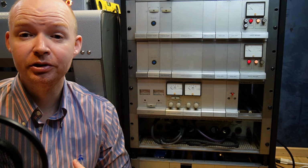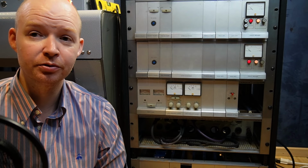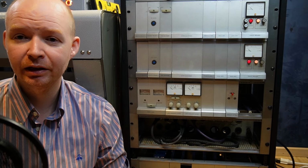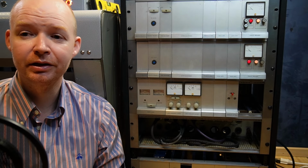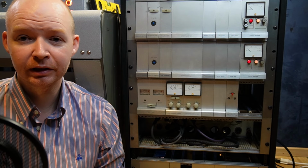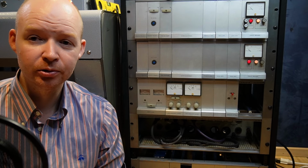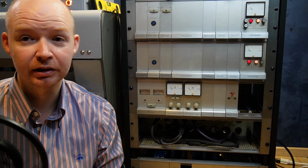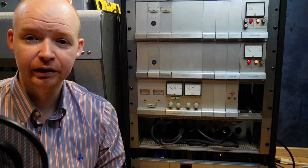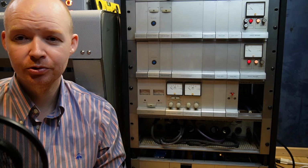As much as I would love to blast everything through the amps at max volume, one of those old cutter heads now goes for over $20,000 US. Nobody's really making new ones in any kind of volume, and I can count the techs able to repair those on one hand. Most of the studios cutting now are small operations with 1 or 2 people, and they can't afford to keep 2 or 3 spare heads on hand just in case. So if someone's thrash metal EP pops your cutter head, you could be down for months unable to take on any new work. So just keep that in mind.